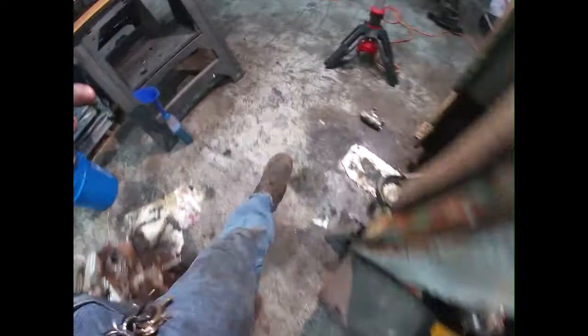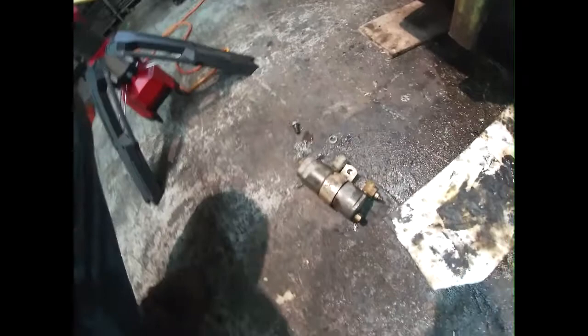There was pressure in it - as soon as I opened the bleed valve, fluid would squirt right out. I cracked the lines at the back of the master cylinders and nothing really came out. So I figured it out: it's the selector valve. Even though I took it apart and cleaned it and got everything working, something inside it was jamming up, wouldn't allow fluid to go from one side to the other, and it kept holding pressure. So I had to take it out.